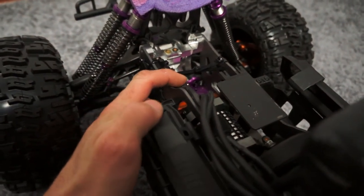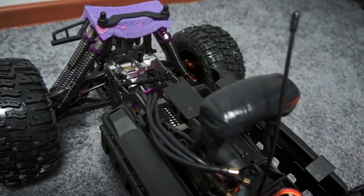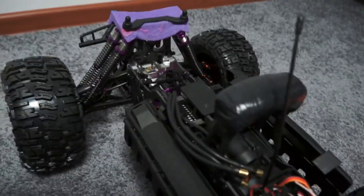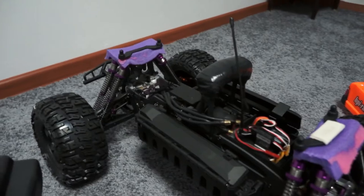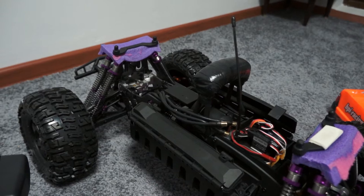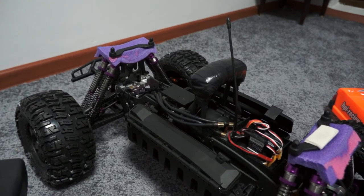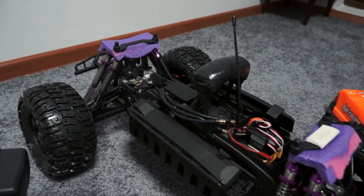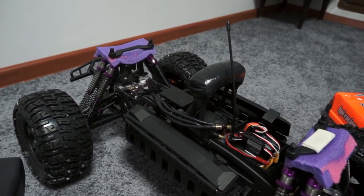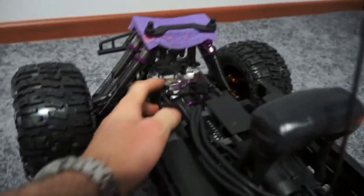So I run a separate BEC, because with a Blue ESC, even with better firmware, there is a maximum you can get. With the standard firmware, you cannot adjust the internal BEC output. With a better firmware, whatever version it is, 1.9 or the latest one, you can adjust the BEC voltage to 7 volts maximum, and I wanted 7.4, so I installed a separate BEC, and I have a separate switch now